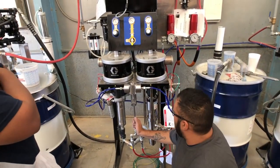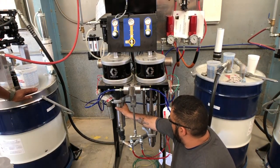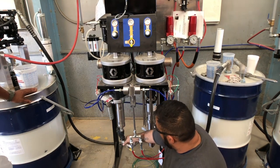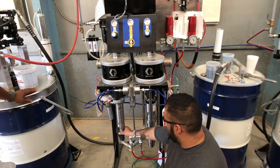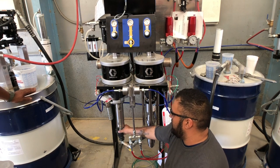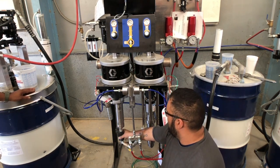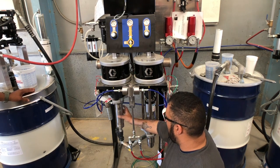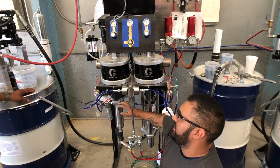The inlet of the A-side pump is underneath, and underneath over here you have a wide strainer, which is the first filter the material sees throughout the system. It filters out any impurities or chunks that might have fallen into the drum. It goes through a check valve, then a foot valve, and then another check valve on the piston valve. That's how it creates pressure by positive displacement.